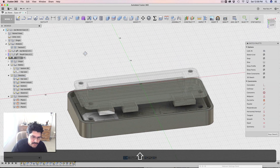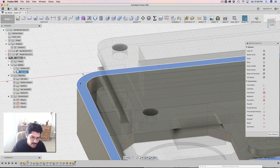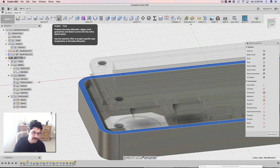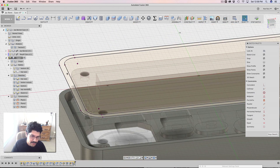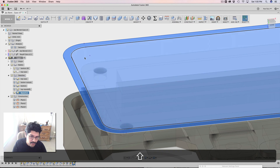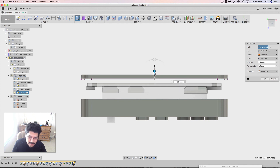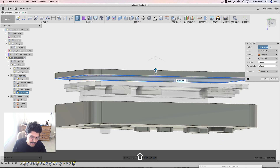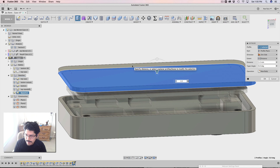Now that I'm in this sketch, I can project some stuff up. I'm going to project this edge here — so with that selected, I'll hit P on my keyboard or use the project button under Sketch. You'll see some purple lines — that's now referenced from this actual shape, so if we ever need to update the case, this will all get updated with me. I'll hit Stop Sketch. Now I'm going to select these two profiles and extrude them outward so that I have the right distance from this surface to the bottom of the PCB — making them the same 1.5 millimeter thickness I've been using throughout. I'll hit okay.